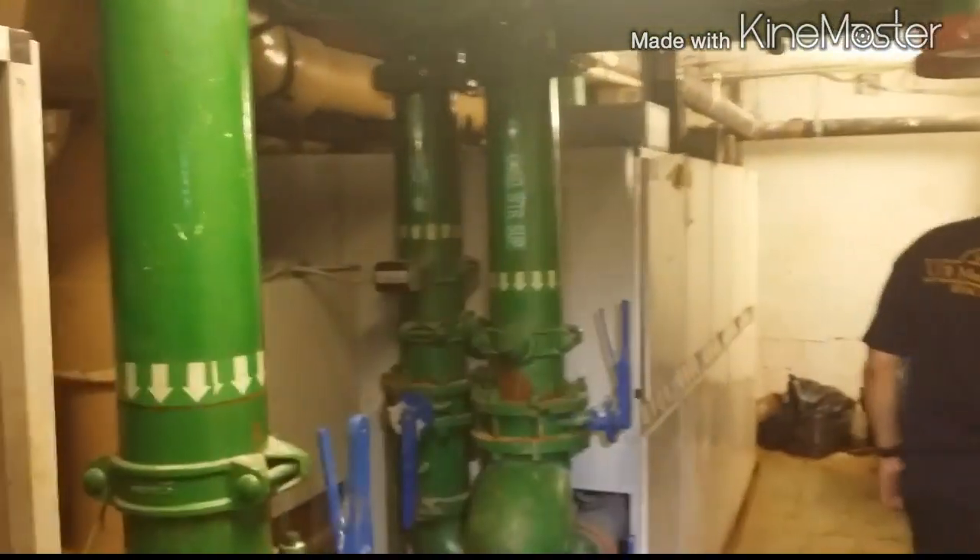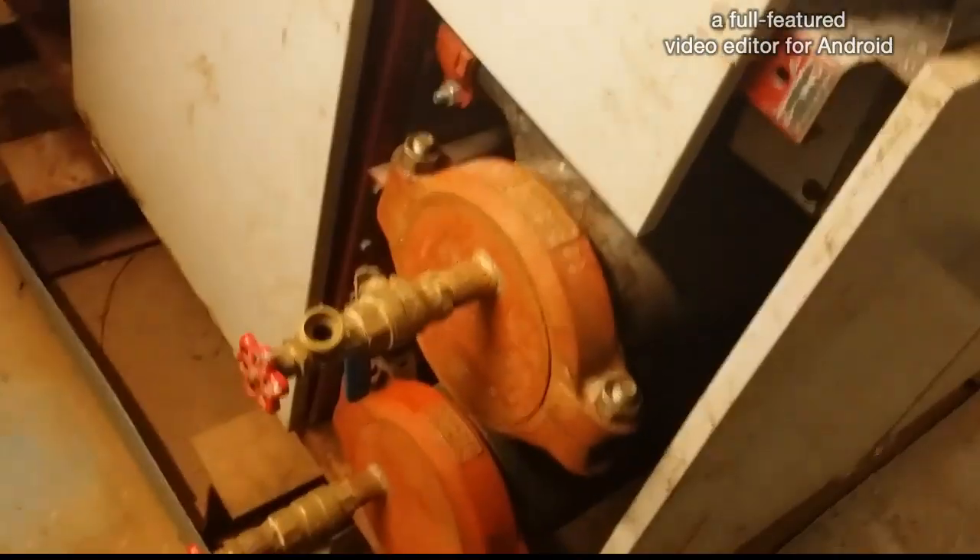And we got that row — another 150 tons. So we're going to shut this guy down. We're going to come to these Victaulic fittings here. We have strainers in them, but we have to pull them — they get dirty. Those strainers look like these guys right here. We're going to pull them, clean them, put them back in. I'm going to show you guys how to do that.